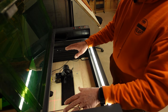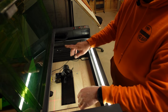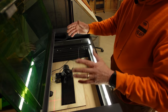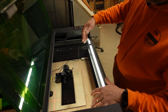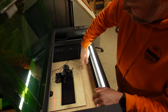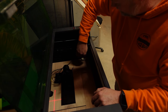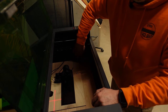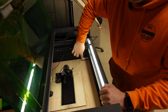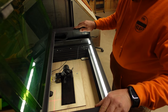That is the one thing with the xTool S1 that I've been having a real problem with, is just keeping stuff still. Because when this machine is moving at the speeds that it moves, that crumb tray wants to slide around. So I took that out completely through the front of the pass through. And what I have done with my machine is, mine is sitting on a piece of wood on top of the tabletop, and I have made myself some little brackets out of some scrap wood, and the lights went off on the machine, so let me get them back on. And I've put some little brackets in here, and I've got some on the back as well to hold the machine, so the machine itself cannot move on the table, okay?